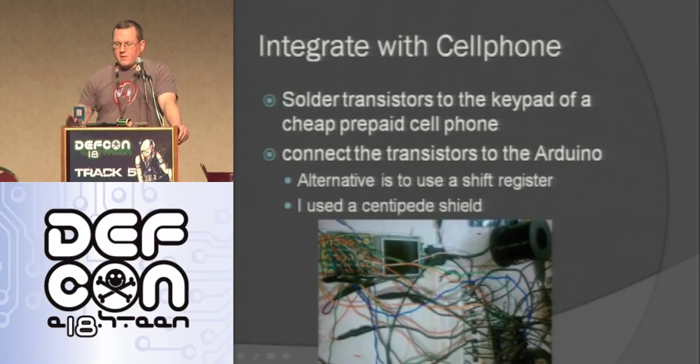What I ended up doing is I pulled off the keypad of this cheap prepaid cell phone that I had. The keypad stopped working anyway from the top, so I just ripped the keypad off — the rubber stuff. Then I just connected transistors to each of the button things on the cell phone. Basically I had a big ring on the outside and then a little circle in the middle, so I just put a transistor between the two. When I put power to the base of that transistor, it essentially makes that connection and pushes the buttons.